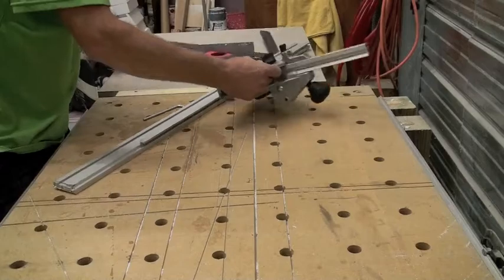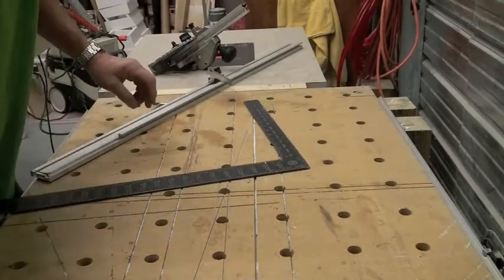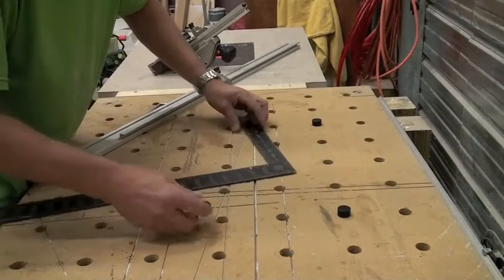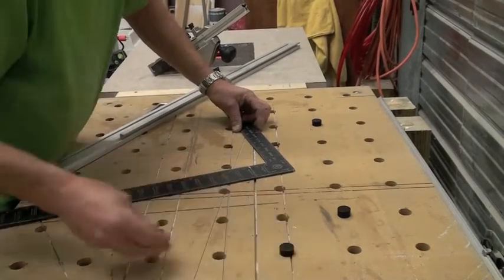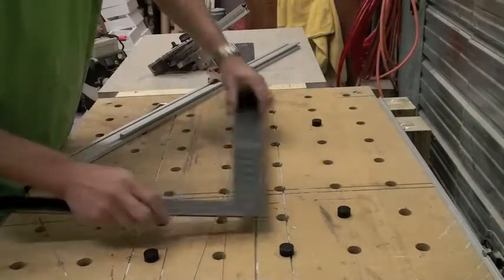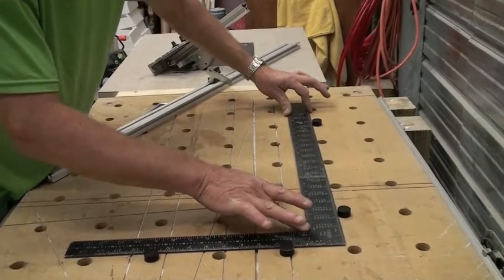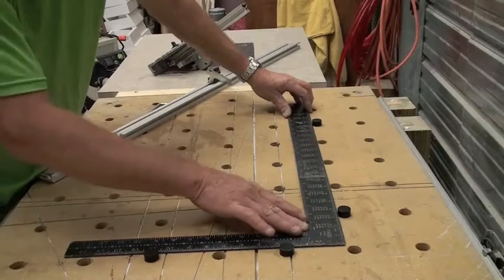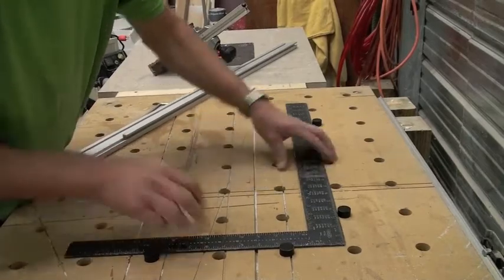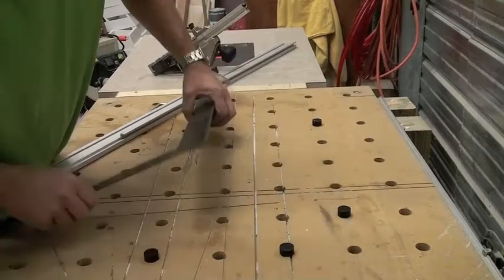Talking about accuracy — I don't have an expensive square. For the sake of this demonstration, I'm going to assume that Festool manufactures these and this grid is square. I have an off-the-shelf framing square. I'm going to put it in here. Can I rock it? No. I can rock the table, I can rock the camera, but I cannot rock this. So I'm going to go with the assumption that I am a lucky guy and this is square. You can try it on the inside and it is good too. That works for me.